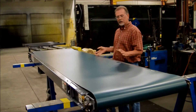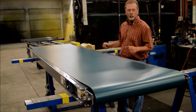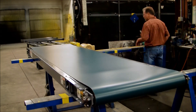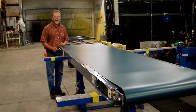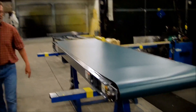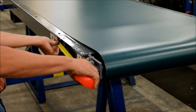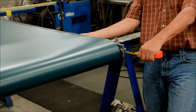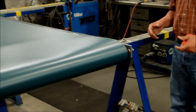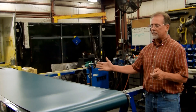The next thing you'll want to do is make sure that the infeed shaft and the drive pulley are square to themselves and square to the machine. Before the video, I took the liberty of making sure that the drive pulley was square just by measuring from the edge of the frame to the center of the shaft. And back here, I'm going to measure from the edge of the frame right to the bearing collar. I've got fifteen and three-quarter inches on this side, and fifteen and three-quarters inches on this side. So now I know my machine is level in the machine direction, and I know that both of my pulleys are square to the machine and square to each other.